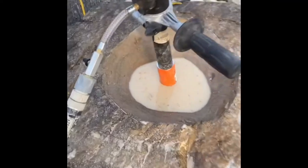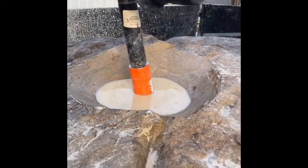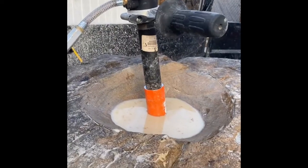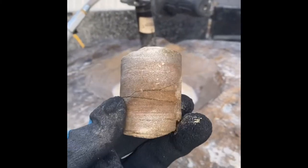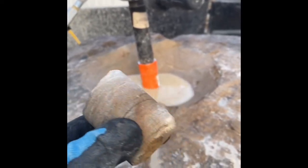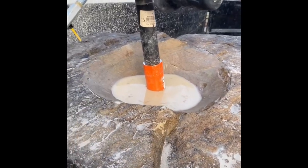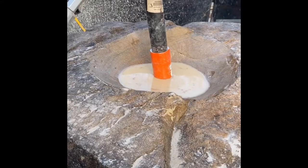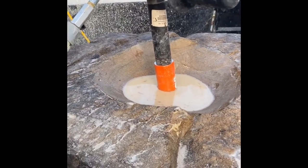It might have to come back tomorrow — it's starting to get dark, sun's going down. We had to put the extension on that bit because my handle was hitting the rock. A lot of people ask about the core — how do you get that out? A lot of times it'll just break off inside the bit. You can pull it off and feel it shaking around a little bit in there. If it doesn't break off, sometimes you just got to put a screwdriver or chisel in there and chip it off and then try and pull it out with the bit. Typically it breaks off in little pieces.